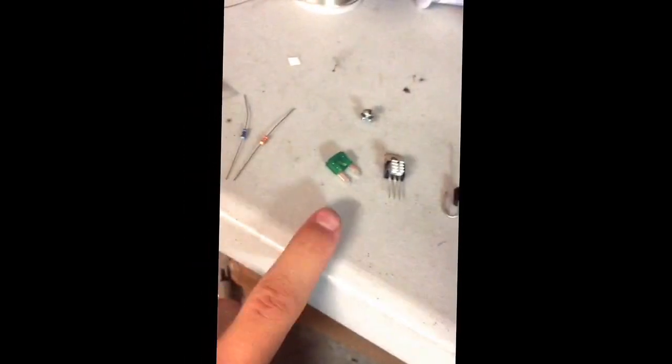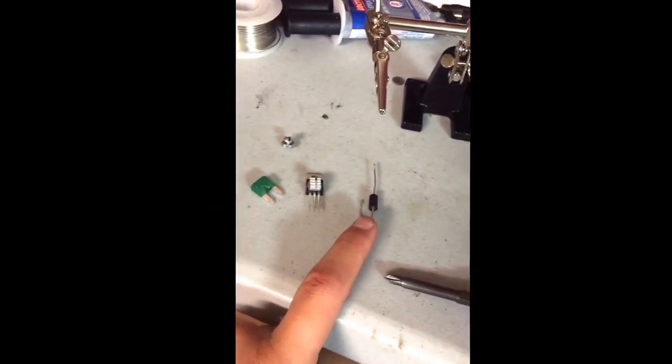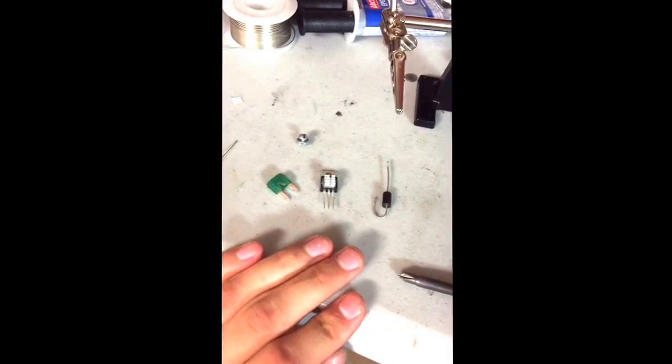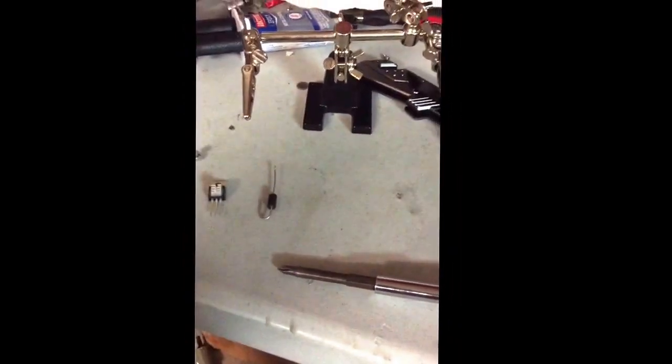What I recommend with those dual MOSFETs is I do dual heat sinks. You know, obviously you're going to need two of these, two 2.2Ks, 200 ohms, and then you're probably going to want two of these. And then I'd run a 14.8 volt battery in your medium gear set gun if you want to try to get a faster rate of fire without blowing a homemade MOSFET and having a very fast trigger response, because not only is it 14.8 volt, but you're also having a direct MOSFET going to the motor, opening up those gates like that, in a sense.